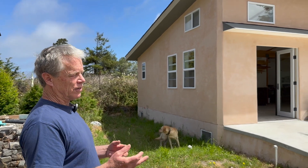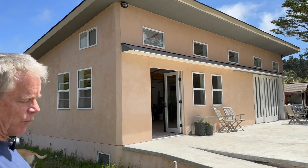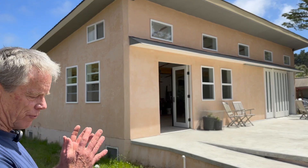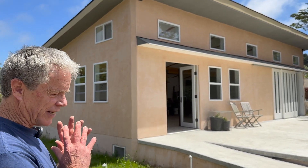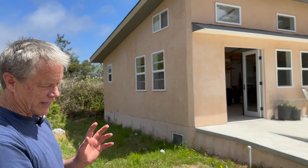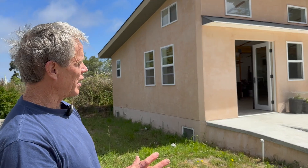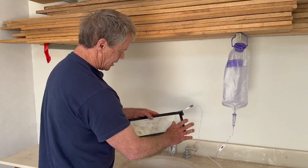This building is a major remodel. We did it to keep the position within a few feet of the property line and not have to be 30 feet away to meet California requirements. It doesn't have stucco on the outside — it has half-inch cement board with a thin coat of plaster, then four inches of foam and four inches of concrete. All the concrete is on the inside, insulated all the way down, not even touching the earth.